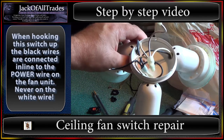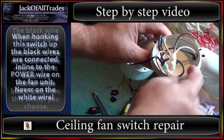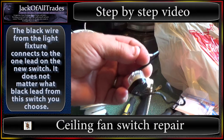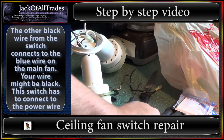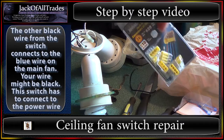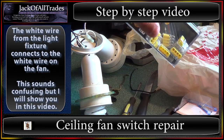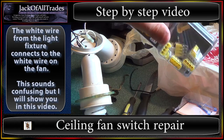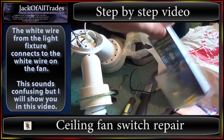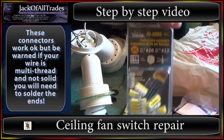This is what it looks like when you take it off your lights. This wire here goes to white and this one has two parts — one on the blue and one on the black. So we'll show you how to hook this up. We also bought these push connectors. All you've got to do is just push the wire into these — you can put four wires in, use one for each side. One for the white and then a different connector for the black. It says right here on the package: number 20 minimum gauge to 12. This is 18 AWG, so that falls within the spec of these adapters.